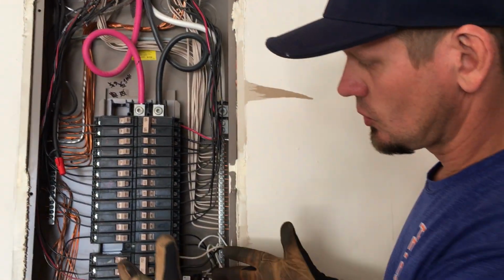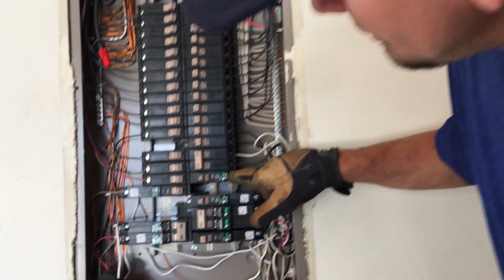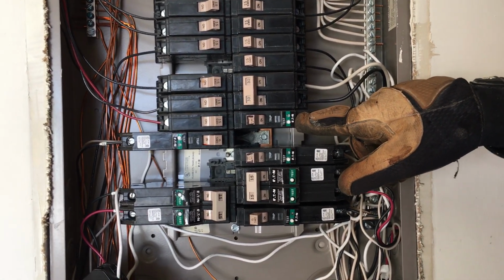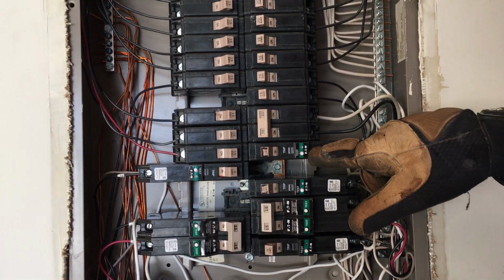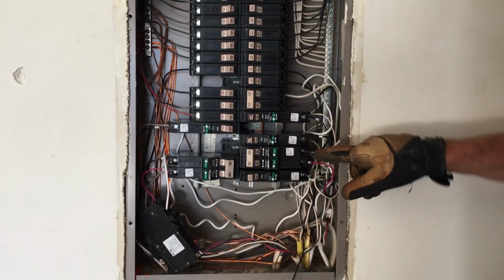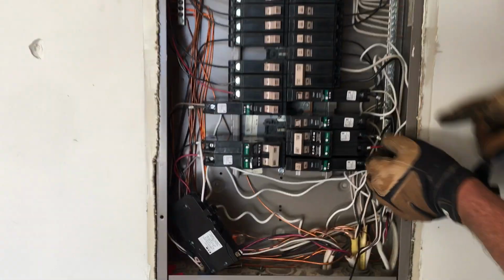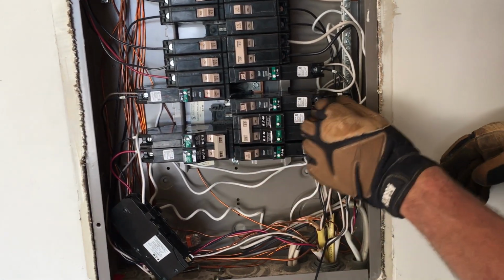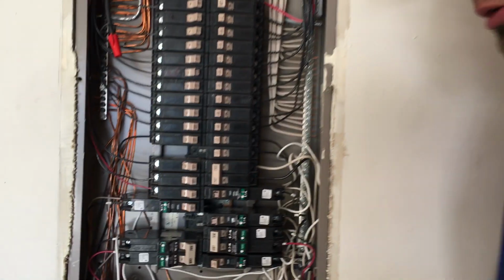Other than that, this is another thing that I'm going to be looking for before I clean up. I was having this guy blink. It actually quit blinking once I reset it, so we're good. So again, testing your sequence and cleaning up this panel is also a very good thing. Making sure your wires are tight, because if they're not or the breaker's loose, that's just going to add to your confusion. Again, we're going to be about 6 hours in this job to trace everything out.